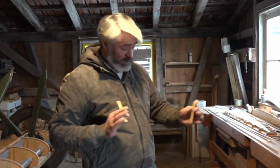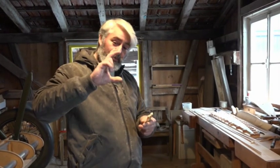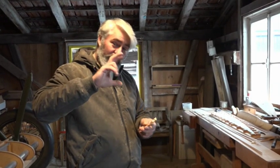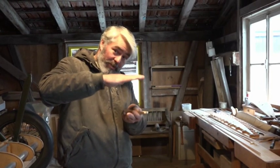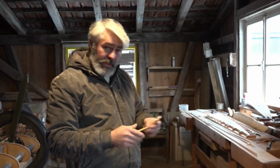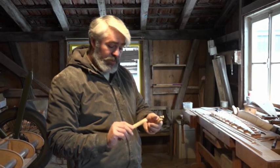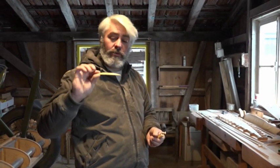These are those reinforcement strips, stringers, which are nailed and glued to the left and right of the rib to take the compression that is produced by the fabric cover to prevent the rib from buckling in. And since we don't want additional weight, we cut off all we don't need.